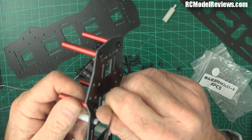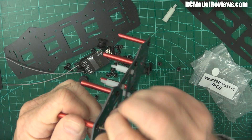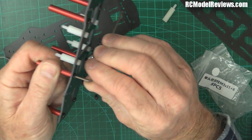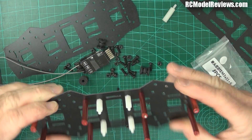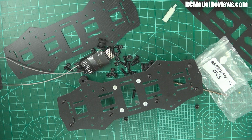If they do come out, they're not going to fall anywhere because there's not enough gap between the plates for the bolts to actually come out. I'm going to talk about maintenance in one of the final videos in this build series, because you really do need to maintain this stuff - anything that moves will wear and things can go wrong. For the nylon bolts, just grab a screwdriver and tighten those up too. Nylon you can't tighten up so much because it tends to stretch - just give them a tweak, enough to get them tightened.